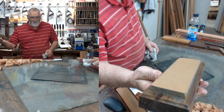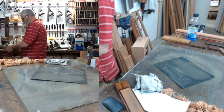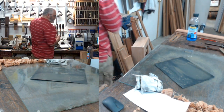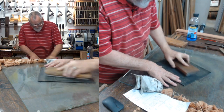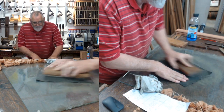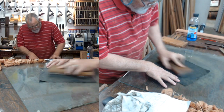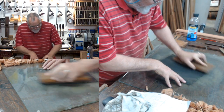Now if you can remember what that looked like before — it's all been rejuvenated and I've got a nice new cutting surface ready to use. I haven't done this one for ages either — it's got a lot of little fine scratches in it, we'll try. You can also use diamond plates to do it and you won't wear the diamond plate out, but at $120 for a diamond plate there's a lot of wet and dry you can buy for that.